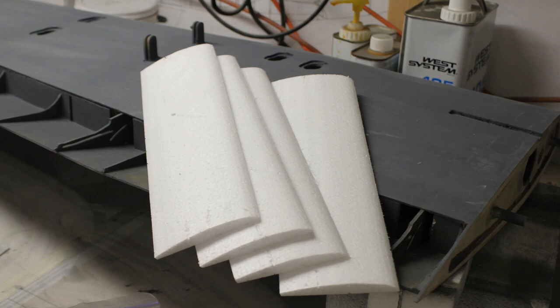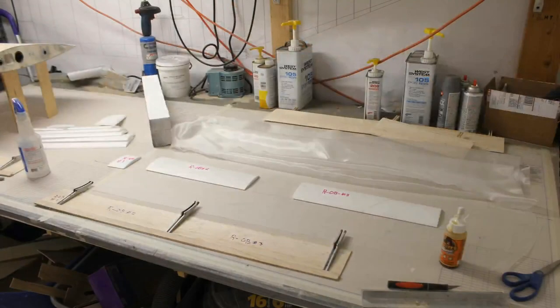These are the flaps cut out of foam. The bottom half of the flap is a balsa wood skin — the trailing edge was balsa because it fits and kind of locks into the wing, and then the foam went in between the hard points. I didn't want to put ribs in there and add weight. I didn't even skin the top of the foam — I put three-quarter-ounce glass cloth over it. I spackled and sanded it but did not want to add any more weight to those flaps.